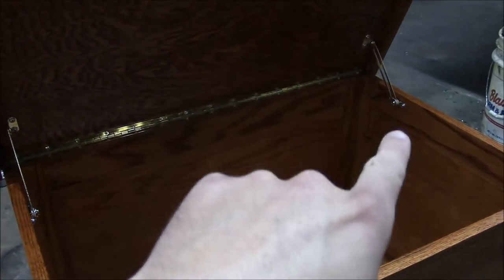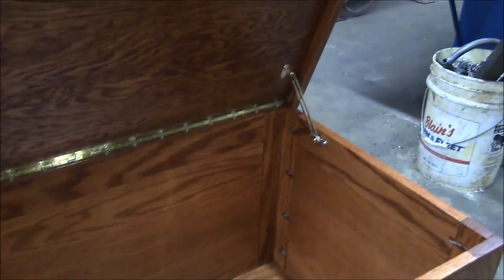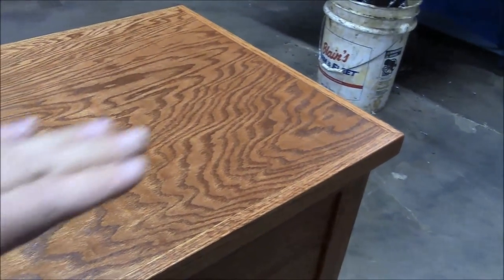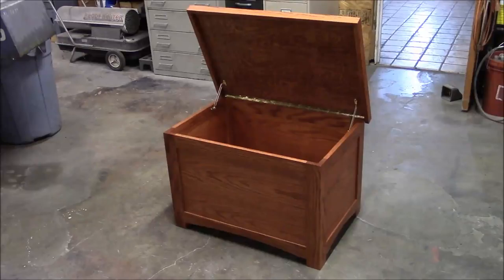I used a regular 30-inch piano hinge along the back side, and then I have these friction sliders — they have a plastic washer and a little spring that just provides some tension — enough to keep the lid up and give it a slow close. I'm trying to minimize the conibear effect here. All right guys, that's enough woodworking for me for the foreseeable future. Thanks for watching — let's never speak of this again.